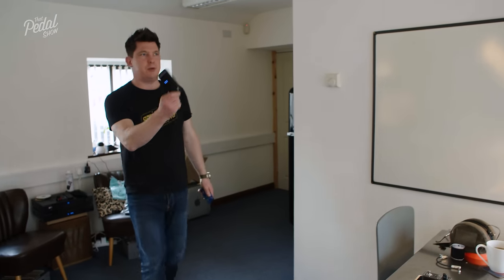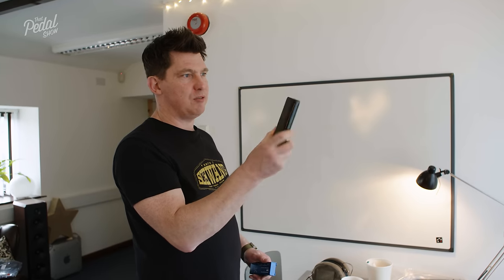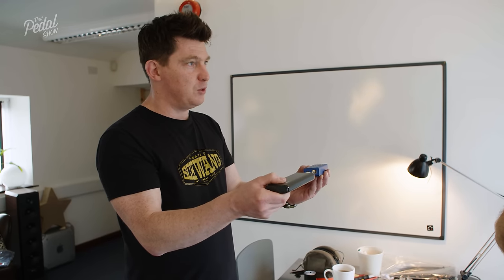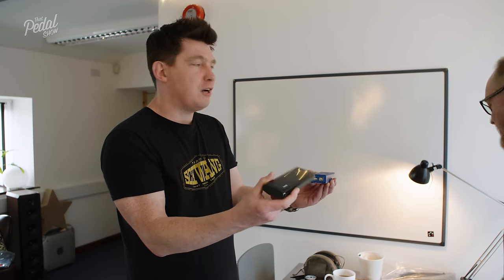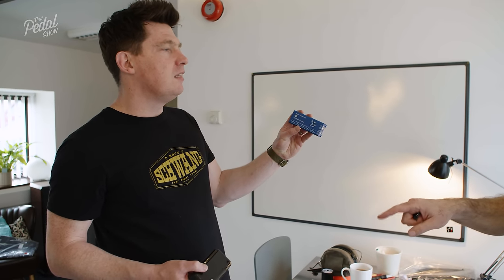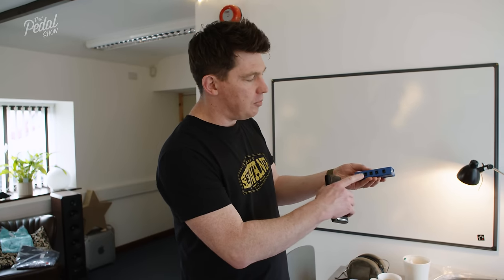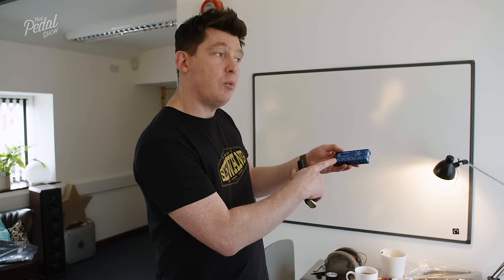and I run it off my separate battery that I carry around to power my mobile phone, if I'm out and about and I need to charge my phone, it's just a battery that you can get. So if I run that off that, what's the result? Well, there's no connection between that and... So there's no ground, no possibility of ground loops, which I think is pretty cool. It's great. And the fact that it's rechargeable, so you don't have to find... Yeah, so what we don't know is how long it'll last. Because I haven't tested it yet, so this will be its first outing today. And it doesn't stop there being grounding issues between the outputs, but it says it's isolated. Okay, great. So we're going to assume that it is.